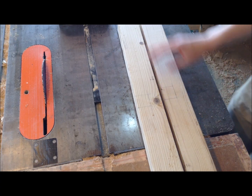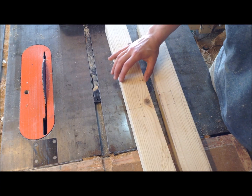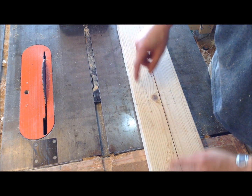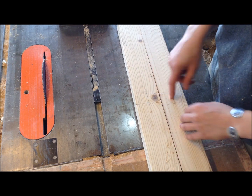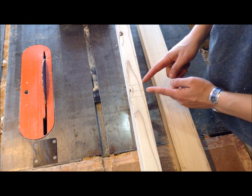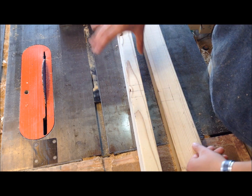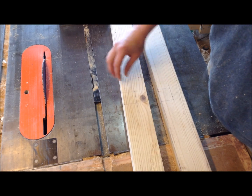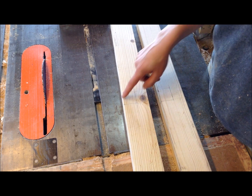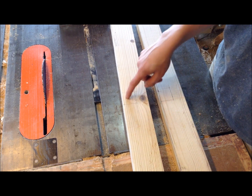I have two sections of that two-by-six. It ended up being two and three-quarters wide and I cut them to about 25 inches. I'm going to cut two grooves and lap these two pieces together. I found center on both, measured out an inch and a half — the thickness of the pieces — then came down halfway through, which is an inch and three-eighths, and now I can cut those grooves on the table saw.